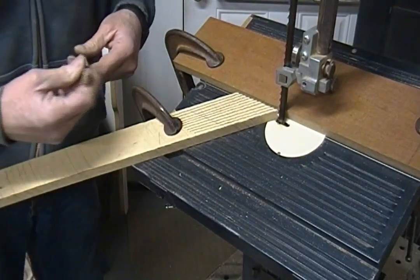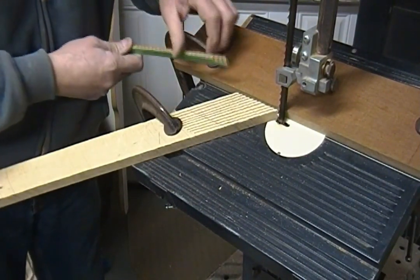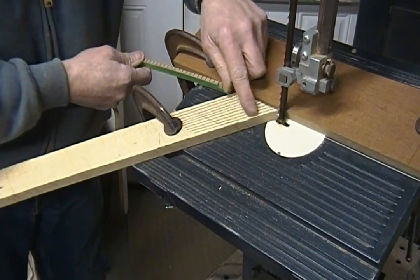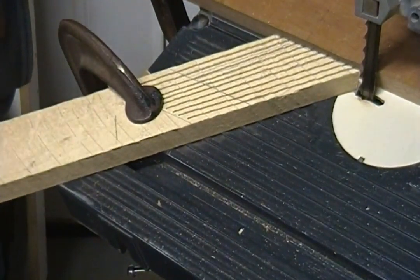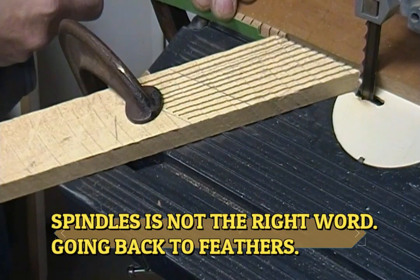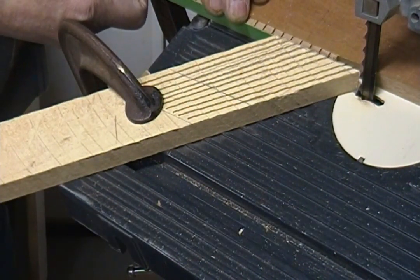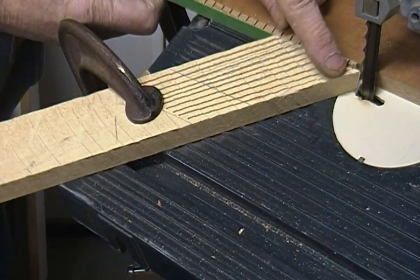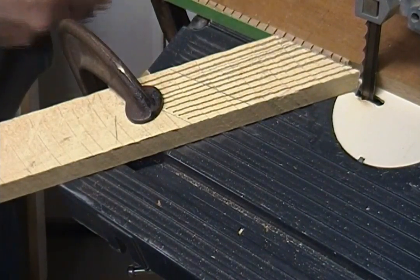Alright, so this is a test run. I've got the feather board on. I've set it up so that if you look at the little spindles there as I push in, you can see that they move just a little bit. And maybe you can't see that on the camera, but they are moving a little bit. And I have this leading pointer just a little tighter. So that's what I'm going to do now.